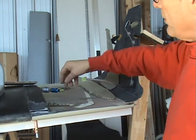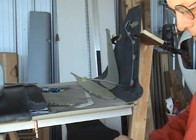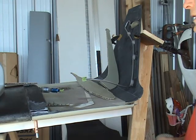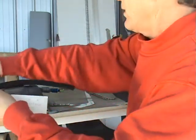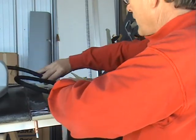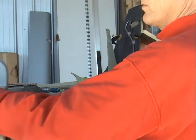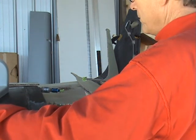And then I need to decide on installing this vent line. There's going to be a couple of ways to do it. Actually, there's going to be a bunch of ways to do it. This Stratoflex or AeroQuip 306, which is listed in the manual as, I believe, 193-6. They show using that, and we can use a fitting here, one of these Stratoflex fittings, and then somehow wrap it around in this wing part here and attach it to here. And the advantage of using this stuff, although you have to search pretty diligently on the web to determine that this stuff is okay in contact with petroleum products.